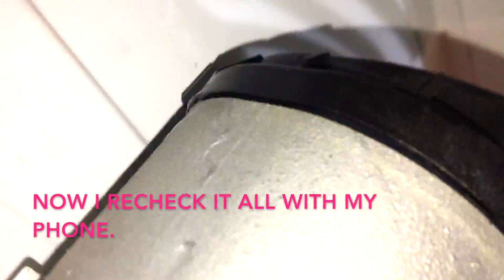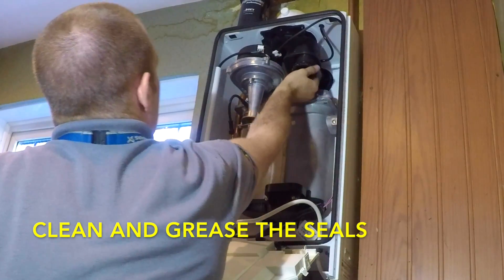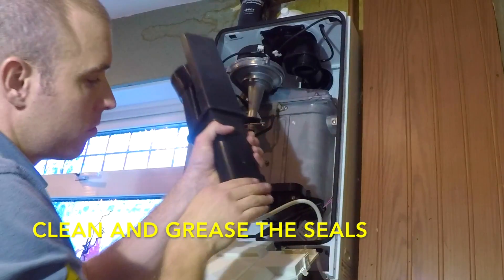The key point of all this is you need to check all around the sump with your analyser. You also need to do your combustion checks with the case on fully and sealed — to make sure you haven't got any combustion POC leaks, no vitiation, and you've got complete combustion.